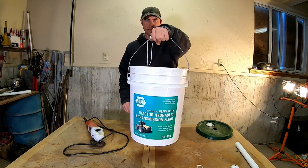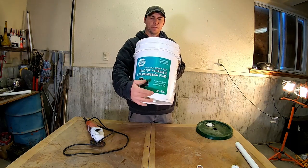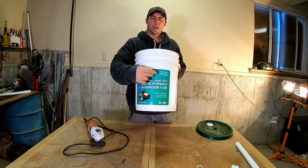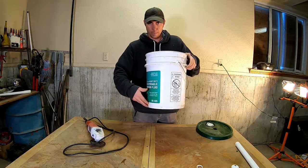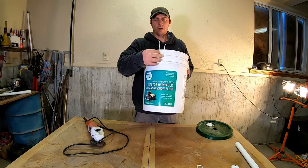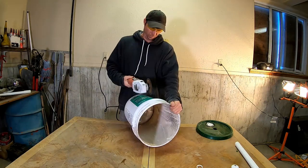just remember, you're holding your bucket kind of like this all the time. I'm gonna cut a slice right through the middle of this bucket here, and this is for the polywire to come into. And one thing to remember when you're doing this is that as that string rolls up, it's gonna be rolling up and down this whole side. So basically, you're cutting a hole in the side of this bucket almost all the way through the top and almost all the way through the bottom, but don't go completely.